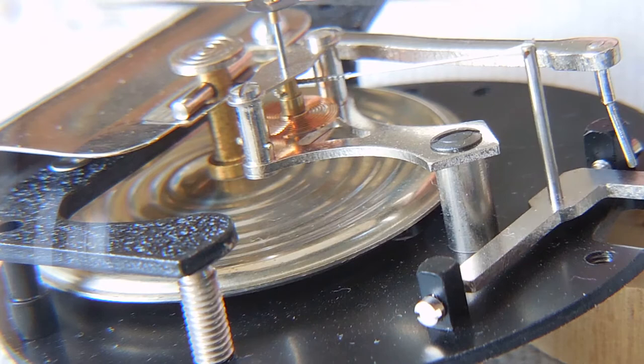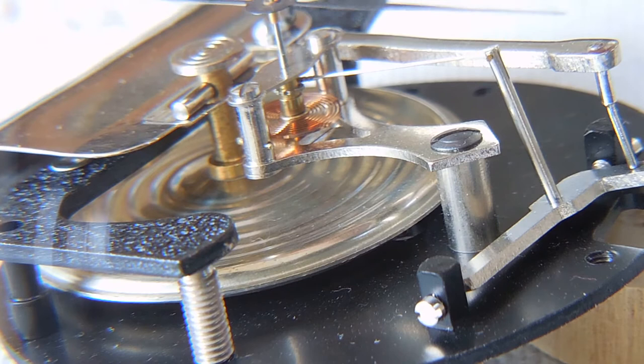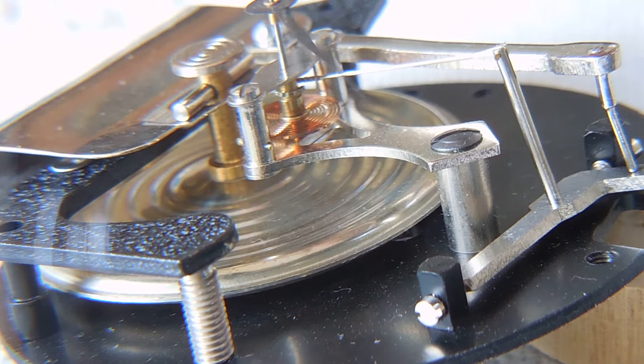I'm pushing it pretty hard so that it moves quite a bit - normally changes in pressure only cause a small rotation. And then there's a coil spring in the center that makes sure it returns back and the anvil presses against the initial lever arm.